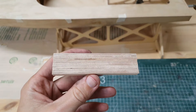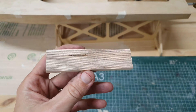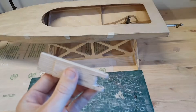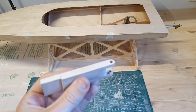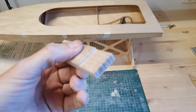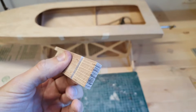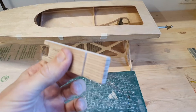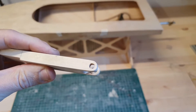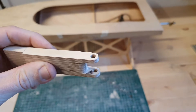This is the first step of my rudder bracket: I glued five pieces of five millimeter plywood together. I made some progress on the rudder bracket — I made a cut for the aluminium bracket that will be mounted to the transom, and put in the holes for the rudder hinge.